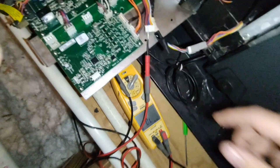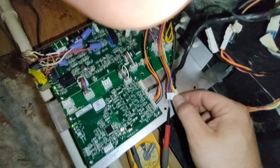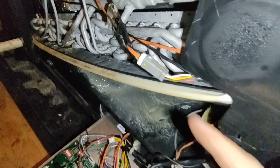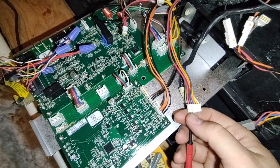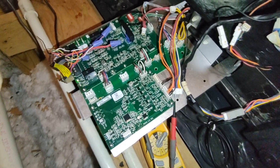If you have the six-wire version, you're going to want to do brown to yellow, brown to blue, red to orange, and red to white. There are six wires here — what we're looking at is right on the plug: one, two, three, four, five, and then it goes into an adapter. With the six-wire, red and brown are your commons to test them out. I'll put that picture up as well.